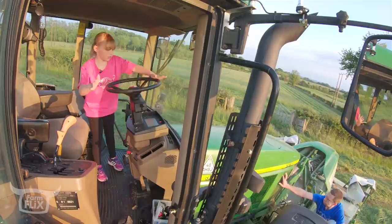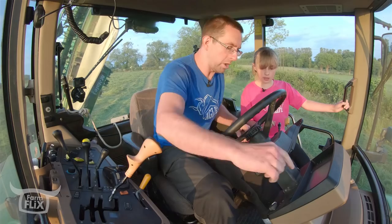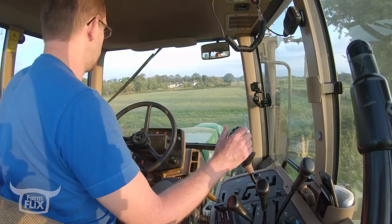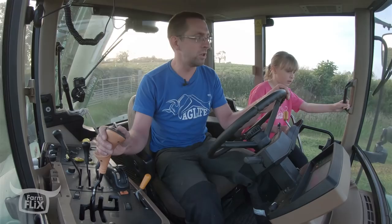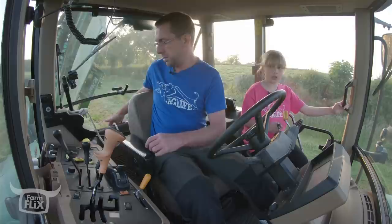Did you see me cleaning the dust off the radiator even? We weren't warming yet. And see that wee gauge there? That's the water temperature. Your engine is cooled by water, and if the water boils, you've destroyed your engine. It's overheated. So what you've got at the front is a radiator. What the radiator does is takes the hot water and tries to cool it a bit before it's reused in the engine. So it needs fresh cool air to work, and all that dust coming off them mowers gets sucked onto the grills and it blocks the airflow. So if you're not careful after a while and keep an eye on it, you can end up overheating and you've destroyed your engine.